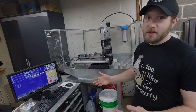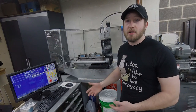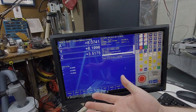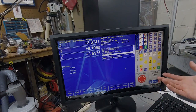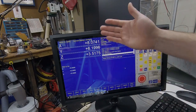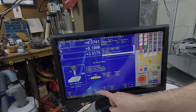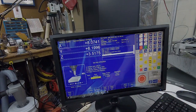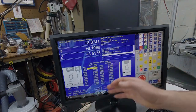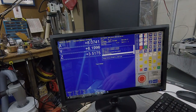I'll move the camera to show you a bit of the inside of the software — we'll go into it further in another video covering the probing features in depth. When you start the software and hit cycle start, it homes all the axes automatically for your automatic zero. Everything's touchscreen so you can go into setups, change all your part probing features, access your tool library, manually or automatically measure tools, and manage your reference positions.